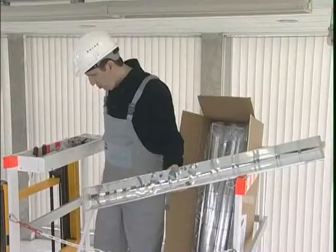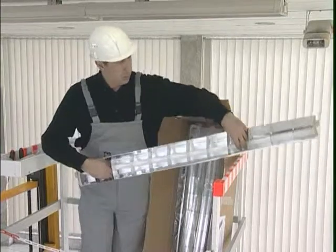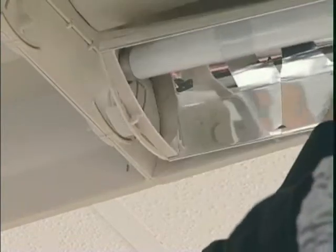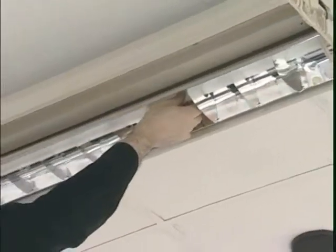The lamp is inserted into the reflector by freely passing through the louvers, and the complete lamp and reflector system is fitted into the luminary by holding the lamp and not the reflector. The lamp pins are first inserted into the end panel guiding channels and then the edge of the reflector setting tab is pushed into the slot of the end panel to secure the reflector.